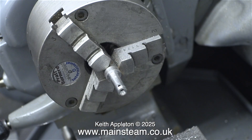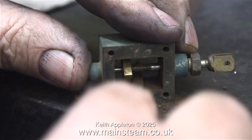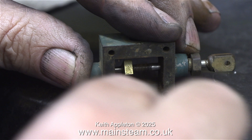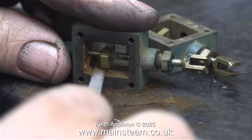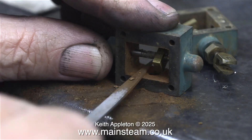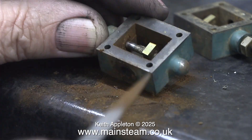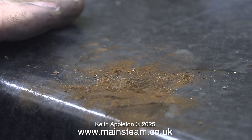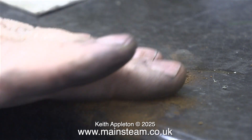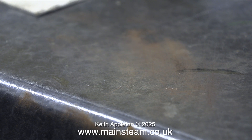All I have to do now is remove the flywheel from the mandrel and that's the job done. In the final part of this episode I'm starting the cleaning of the steam chests by removing the rust from the inside. This is what can happen if you don't feed WD-40 followed by steam oil through the piping into the engine after a steam run to chase away the water — these small parts contained a lot of rust. That's it for now, stay safe, stay healthy, thanks for watching and I hope you found it useful.